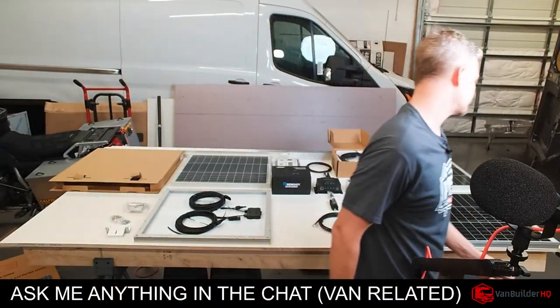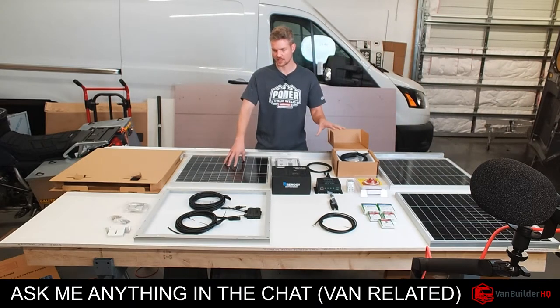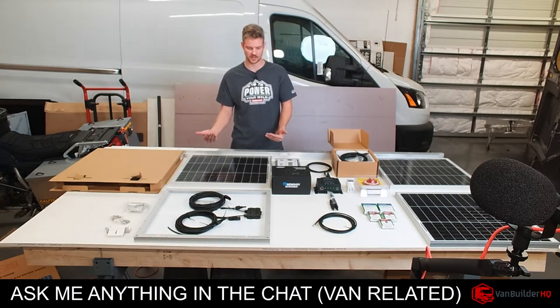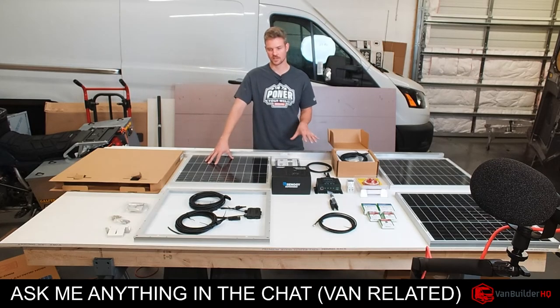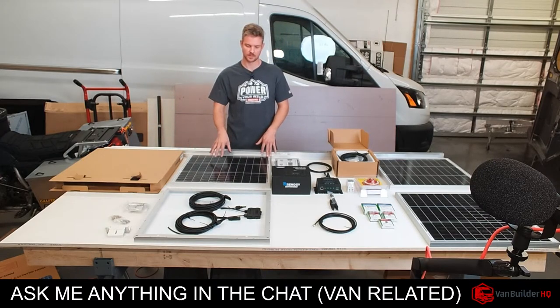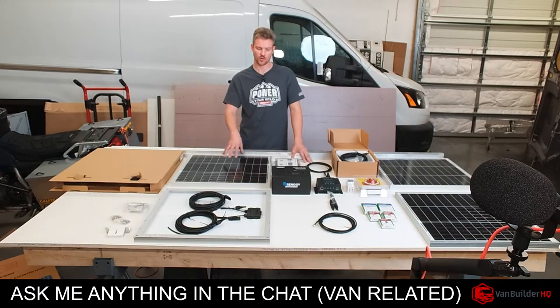So coming back over to the table, we've gone with four 50 watt panels. You guys saw the layout on the roof. Now, the reason that you want to select a separate system for an additional system has to do with the efficiency of the solar panels. For example, if you have 172-175 watt solar panels, those have a different voltage than the voltage of these lower wattage panels. And it's just a rule of thumb to not mix different voltages together. If you do that, it decreases the efficiency significantly, regardless if you wire these in series or parallel.